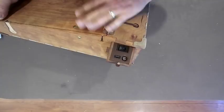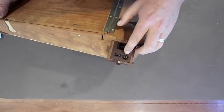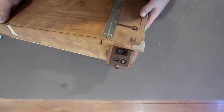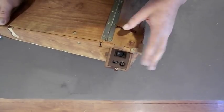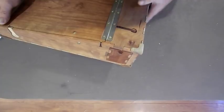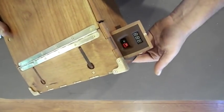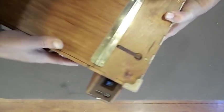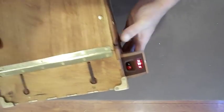In this particular machine, we actually managed to hardwire the AC, and so that's why this is not doing two purposes, and in a lot of our gear it is. In any event, solar input here. And our standard 27-watt panel will happily charge this machine very quickly, just a couple hours in decent sun. And then on this side, again, voltmeter and Anderson. If I were to open this, power up, you see our voltmeter is running.